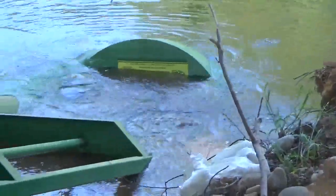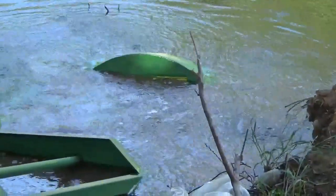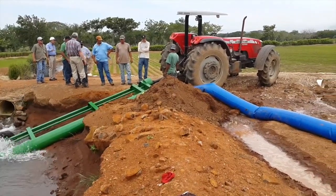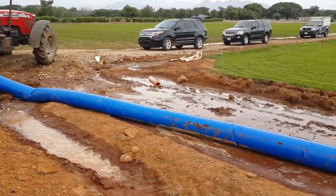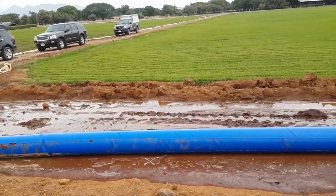In this case the river is a pretty consistent level, but if the water goes down and you need to be deeper, you just back deeper into the water. If you need a longer pump to do that, we'll build you a longer pump. And we don't worry about cavitation — cavitation isn't going to hurt this pump. It's an open impeller.